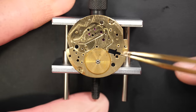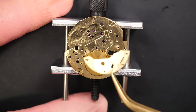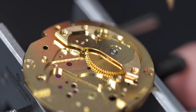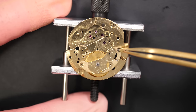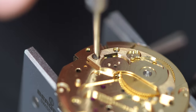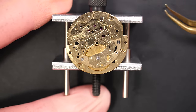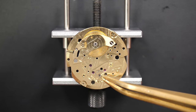Putting some drops of oil, placing the mainspring and screwing the setting lever screw, then putting the bridge on top. You don't see much difference between before and after cleaning on this watch because the movement was quite clean. But sometimes — especially in the jewels — you can't see it on camera, but under the microscope you can see tiny drops of dried oil or grease. That's why it's very important to clean it in a proper machine even if the watch looks clean.